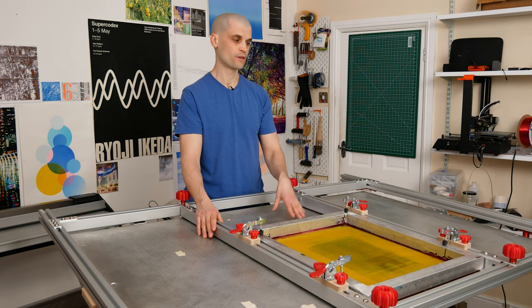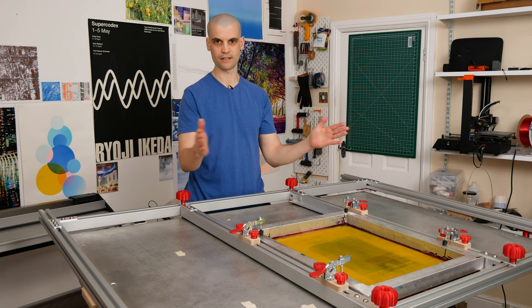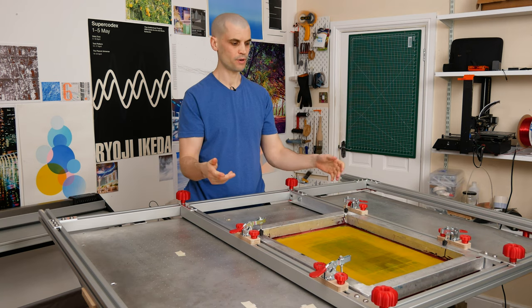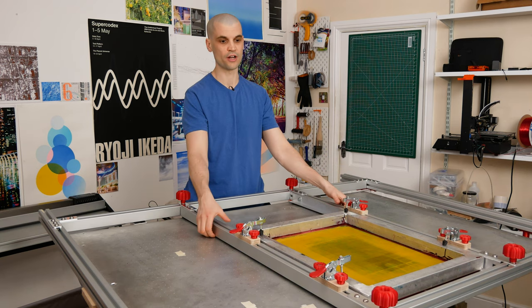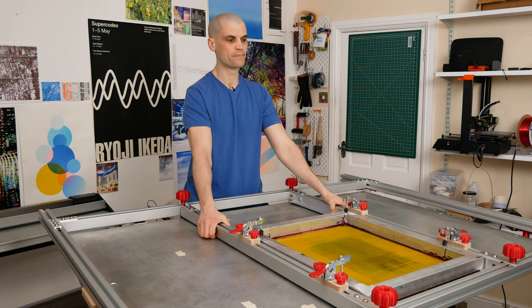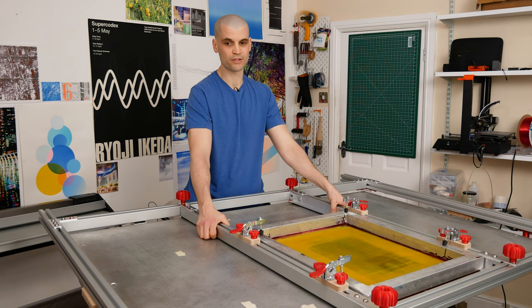Now to my horror, when I built the outer frame and I had it all set up, it could easily move left and right, and it was not stable at all. It's only when I clamped in these middle rails and clamped it into a frame that the whole thing became really sturdy, and you can't move it left or right, it doesn't skew or anything like that. So really I don't think I needed to buy such big beefy aluminium extrusion. I probably could have gone with a smaller and cheaper size. I would have probably used 30 by 30. I think that will be sufficient enough.